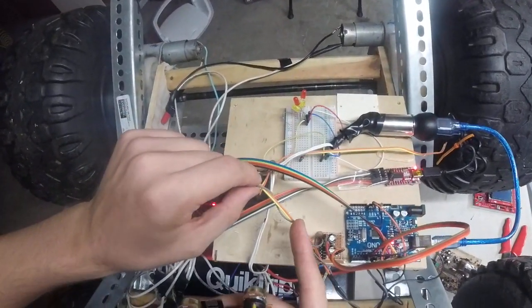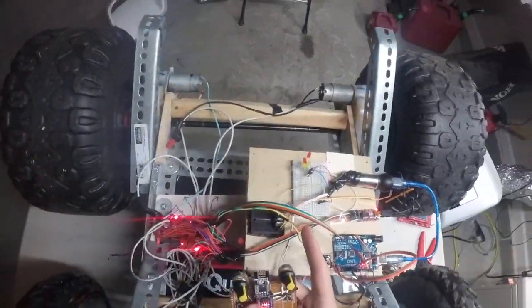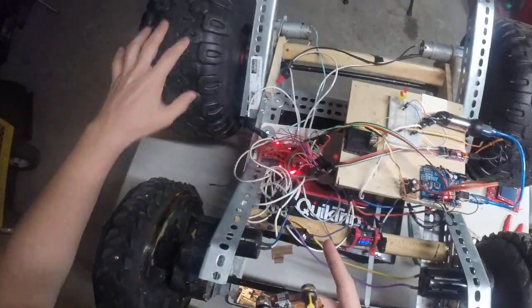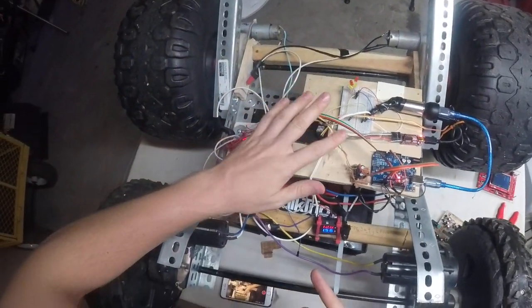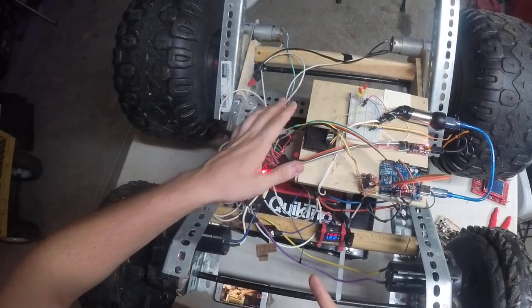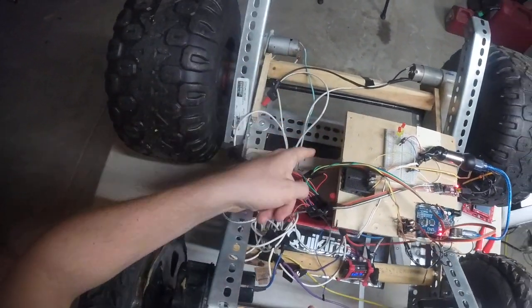These 330 microfarad capacitors seem to do the trick. And you see this wire wrapped around it — that's a ground wire, which helped out a lot before. It's still jittery; you see how much it's jumping. It's probably just the capacitance in these wires right here. But wrapping that one wire around really helped.